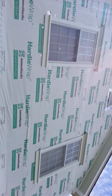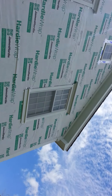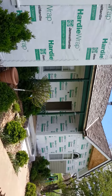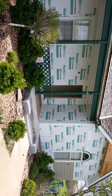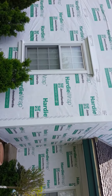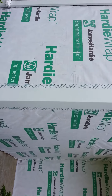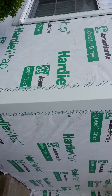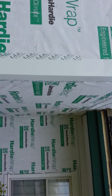We cut a new window into the gable up here. Front concrete is poured. We've got proper protection on the corners — not only house wrap but aluminum — double and triple protecting the corners here, because we are doing a weaved siding pattern with no trim on the corners.